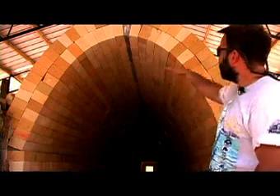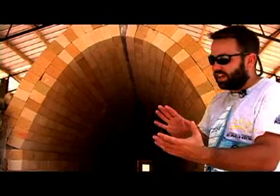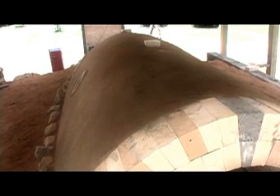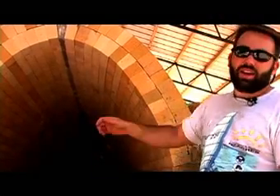After we did that, we covered the kiln with two layers of clay — it's clay and a lot of sand, probably mostly sand, just enough clay to hold it together. The first layer is about three to three-and-a-half inches thick, which was about 25 or 30 batches — a couple of three tons probably. We laid that one day, let it dry overnight, then laid a second layer on top with the same sand and clay mixture plus a little Portland cement. That outer Portland layer is about an inch thick and it seals up the kiln, giving it a bit more strength and weather resistance.